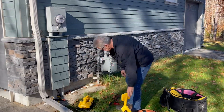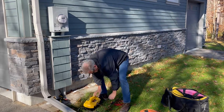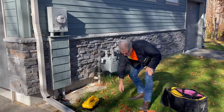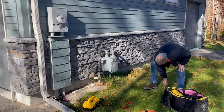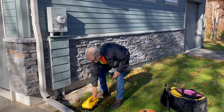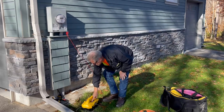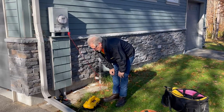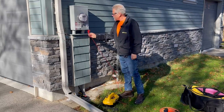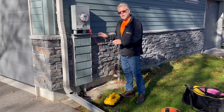I'm going to start off clipping on the meter base with my transmitter, just plug it in, grab my ground stake, put the ground stake over here, ground it, and clip on the meter base itself. Turn the transmitter off for a sec, and I'm just going to clip right here on the meter base itself, turn the transmitter on. It confirms we're putting out zero milliamps — we're not launching any signal yet because we haven't made a good connection. So we'll scrape a little bit here, and now I'm putting out 10 milliamps, 15 milliamps. We have a good signal launch now.